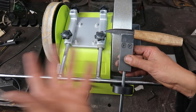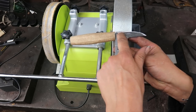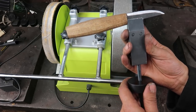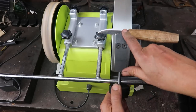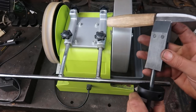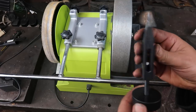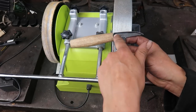I'm not going to show you the whole grinding sequence, but I'll show you a few tricks. You can see here that I need to grind a bit more in this area. What I do — and what I always teach — is to flip it over, put your finger over the area that you want to grind, then turn the machine on and when you turn over your finger is in the right place to apply pressure. You can see very quickly I've ground that section away. It's just a question of working back and forwards, turning it regularly, until the bevels are matched and even, and you'll get a perfect hollow grind.